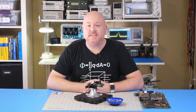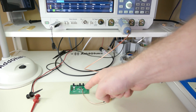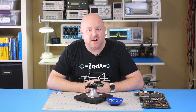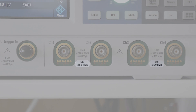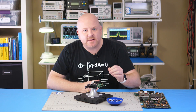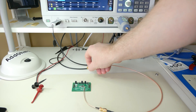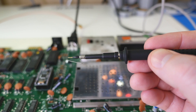An oscilloscope is great for measuring the peak-to-peak noise or the AC component of a DC voltage rail. For the DC-to-DC converter I soldered a pigtail coax to my board. When using a coax cable like this you must be careful not to exceed the scope's maximum input voltage since it is a one-to-one attenuation. Some scope companies even make a special power rail probe specifically for this measurement, which solves that voltage problem as well as a few others. The cable then connects to the special probe. When we get to measuring the C64's rail voltages I will use a broader version of this special probe.